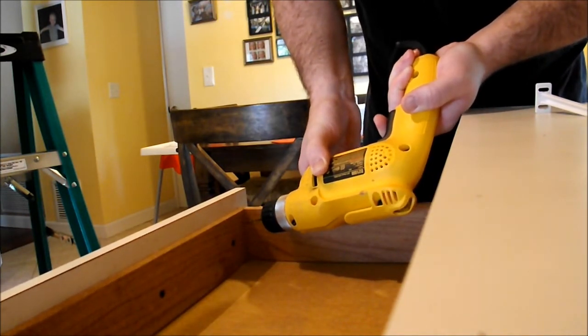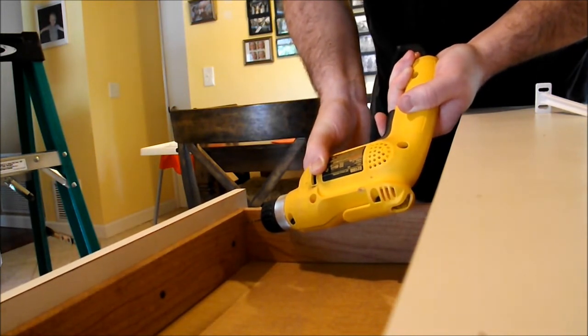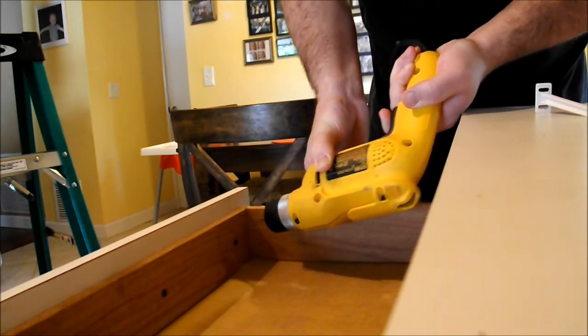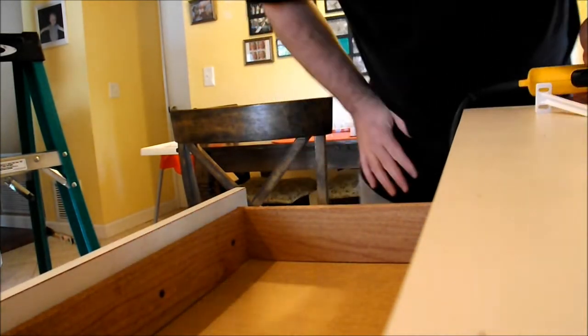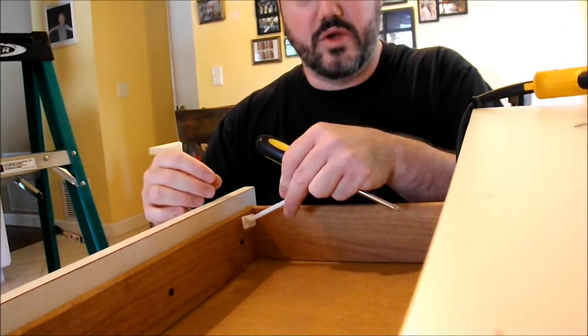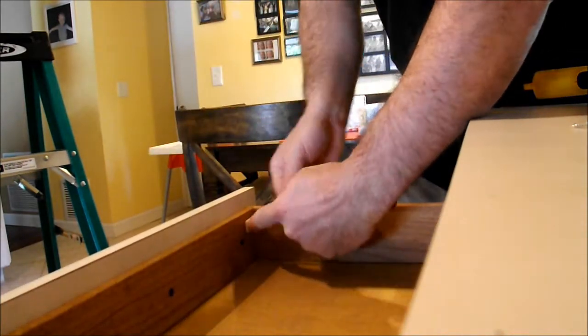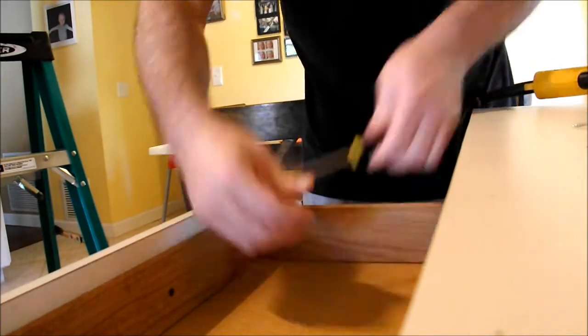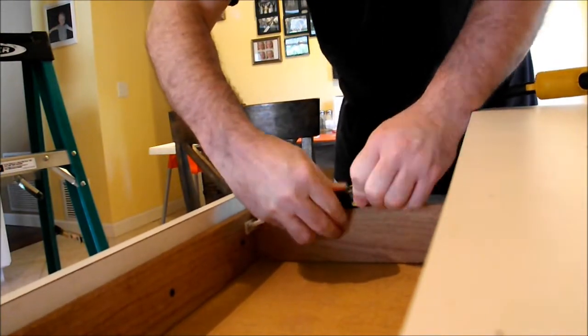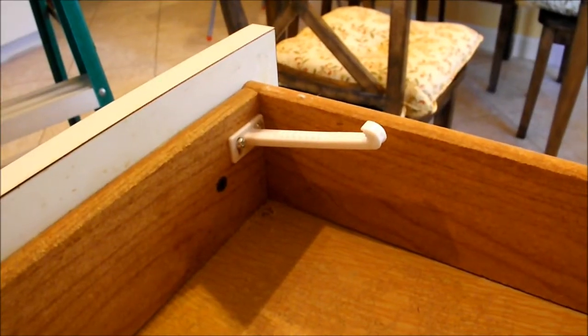You don't want to drill too much — you can install a stop or put a piece of tape on the drill bit to see where you should be stopping. I'm just going to eyeball it for this project. Just a little bit of hole so the screw knows where to go. Next, take two of the screws that come with the latch and screw the hook in. Now that it's screwed in, I'm going to make sure it's the right height by simply closing the door — it's right where it's supposed to be, just coming to the top of the opening without touching.